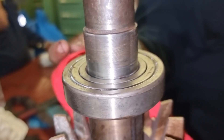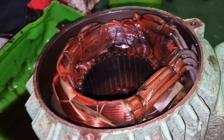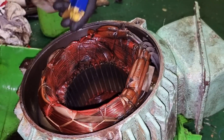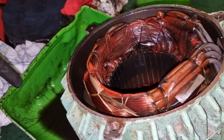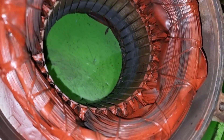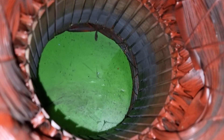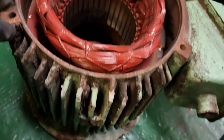It was that easy — same thing was done for the other bearing. Since the winding was still in good condition on the line-to-line and line-to-ground checks, it is healthy. For those asking: line-to-line resistance should be around 0.1 to 1.2 ohms, and line-to-ground should be infinity. We used a spray to clean the windings since we had used up the electrosolve on one of our cargo hold fans. After 24 hours of drying, we simply assemble the electrical motor back the way it was.